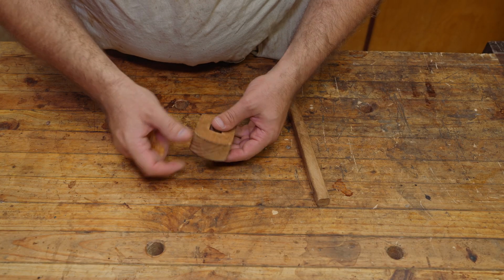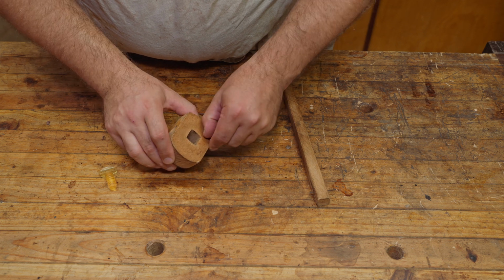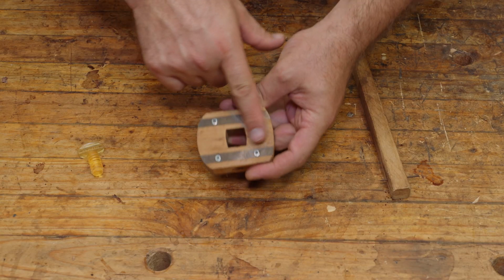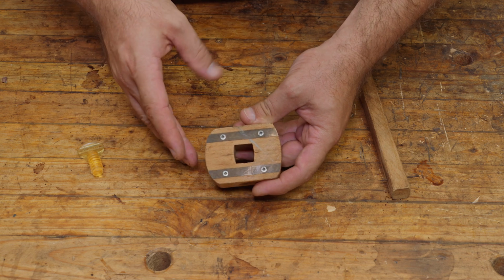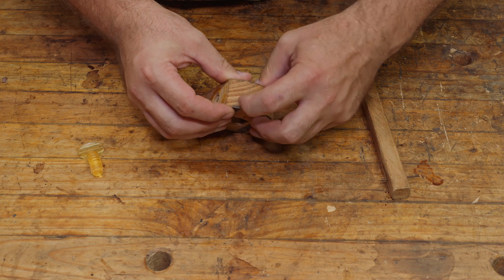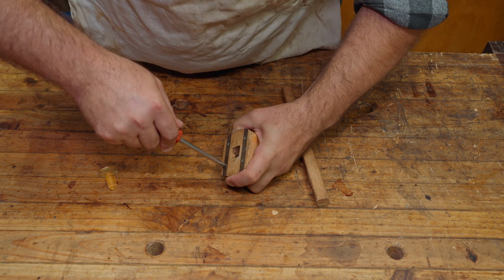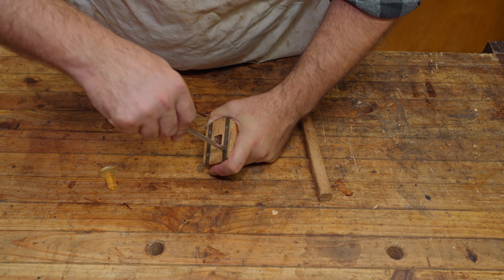So what I'm going to have to do is, because I'm pretty sure this is shellac, and there's a little bit of glue just here and just here, we're going to have to give this a little quick cleanup. And we'll tighten up these two strips on top here first, make sure that we've got them down nice and tight. If we can't pull them down quite as tight as we'd like, I'll drop a little bit of super glue behind it to actually hold them down. So it's important to get a screwdriver that'll fit these, and this one is just big enough to fit into these.